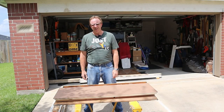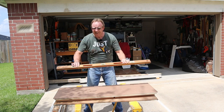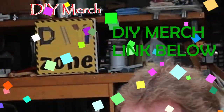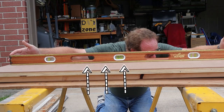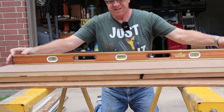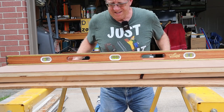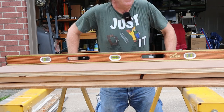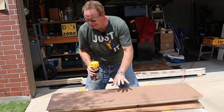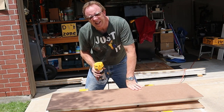It's the next day. This is all set up and ready to finish this project. Some of you might be asking just how flat is that — let me show you with a four foot level. I'll just lightly touch the edges and push it across. There are absolutely no gaps, no rocking. Now what it's sitting on is not level, but the sled itself is perfectly level. So next I'm going to use a flush trim bit and go around the edges to get it flush with the plywood underneath, then get my table saw out and cut it down to make sure both sides are good and even.